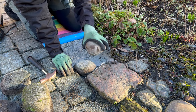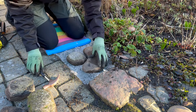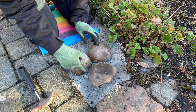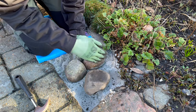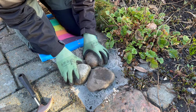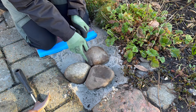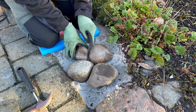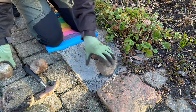Another thing to watch: when laying these stones, you do not want a flush line running through them. If the joints all line up in one direction, it won't look natural and the stones won't attach properly. You want it to look as natural as possible, so each stone should break the line of the previous one, almost like a river flowing alternately each way. Having a continuous open line is a no-go when laying these stones.